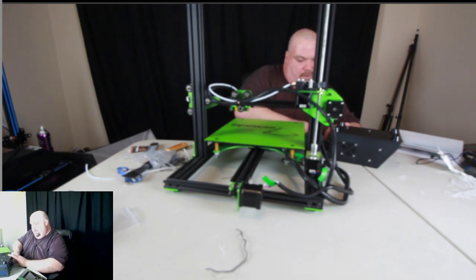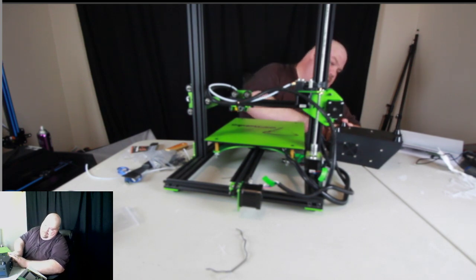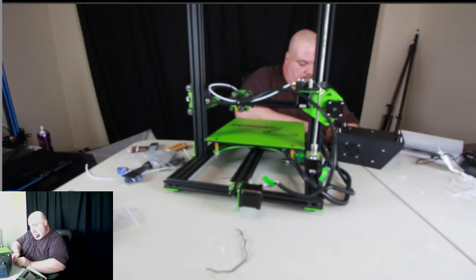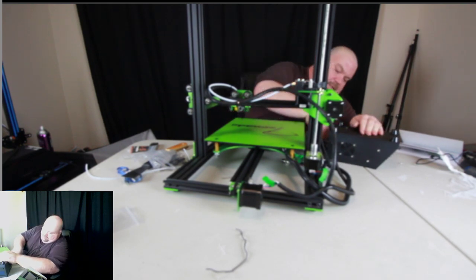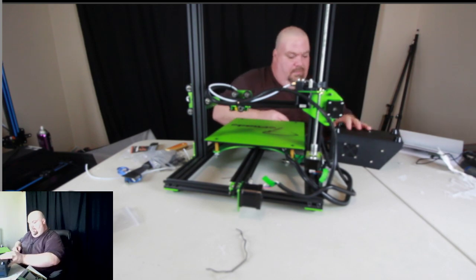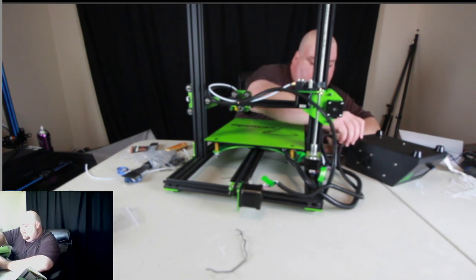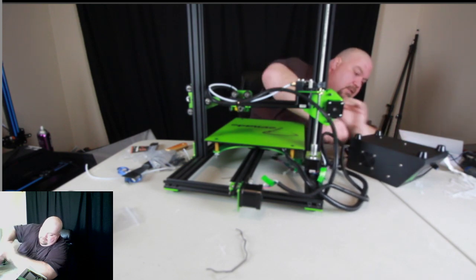Seems like things never quite work out the very first time, do they? What I'm guessing right now is that there is a switch. Since this is set up for the EU, I'm thinking the power supply might be set to 220, and 110 doesn't really run. Or hoping, I should say, more so than anything. The switch is on the side of the power supply inside the box, and I need to switch it to 110, and it should work.